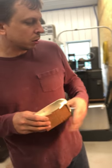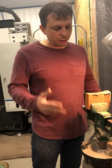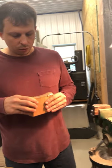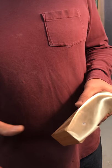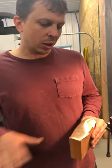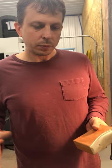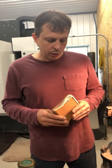One note, I'm gonna talk a little bit about quality or level of finish. In this case, I got a pretty good finish so far. I didn't worry about taking out every scratch from the previous grit. When you cross sand, you can take out all the scratches in the previous grit and end up with what would seem like a perfect finish.